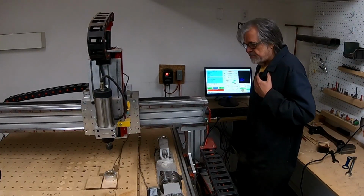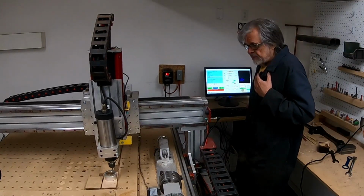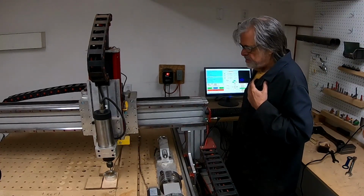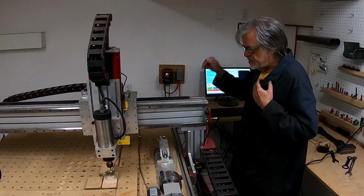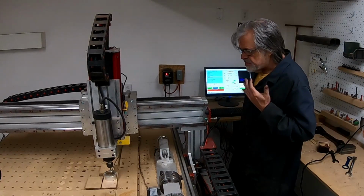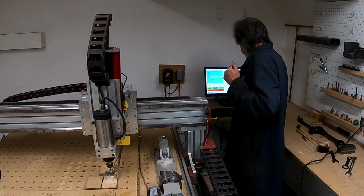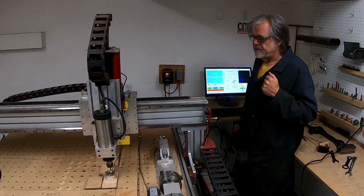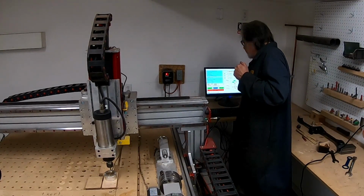And that's a good illustration of, even if your finger is on the e-stop button, as soon as I saw that it was going bad, I pushed the button, but it still went fairly deep. Didn't quite crash the machine, didn't ruin the part for sure, but it's something that you gotta be careful in CNC. CNC, especially the first time you run a part, stuff can go wrong.